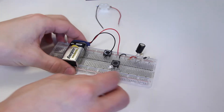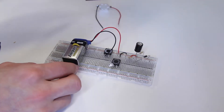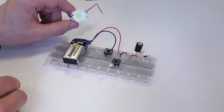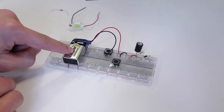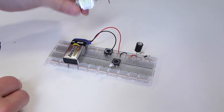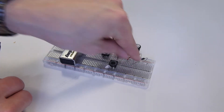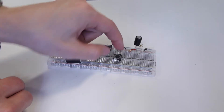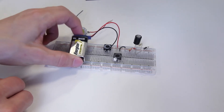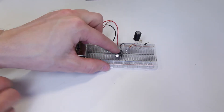That's the point — you can change out the LED. If you use a normal LED, you're going to have to be more careful with the current limiting resistor. When I was using this one, I didn't really use a current limiting resistor — it has a 12-volt voltage drop and this battery only provides 9 volts, so it can't get the current it needs to burn up, which is of course what you're trying to prevent with a current limiting resistor. This one, however, will burn up if you don't have the current limiting resistor, because it runs at 2 volts and we provide 9, and it will only need 20 milliamps of current.